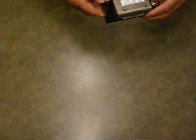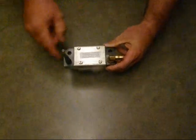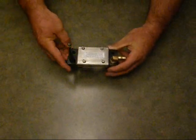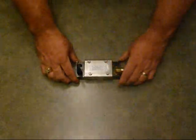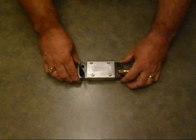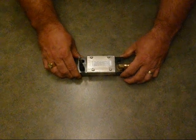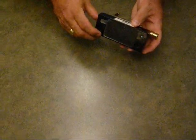When mounting the sensor, there'll be a bolt supplied, or you can use one of your old bolts with a nut, through here and attaching it to the surface. You can come through either hole or you can come through both. What's essential is that you put a spacer washer between this surface and the mounting surface so that it's slightly lifted off. And that's just so water can properly drain and that the gauge port on the back can measure atmospheric pressure.